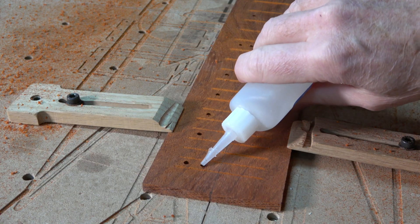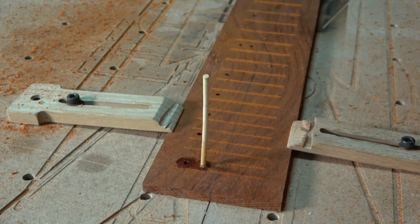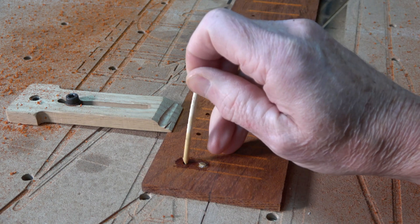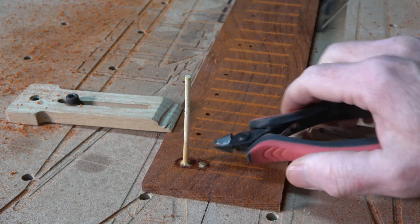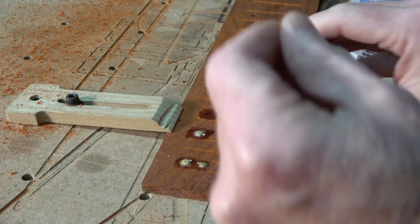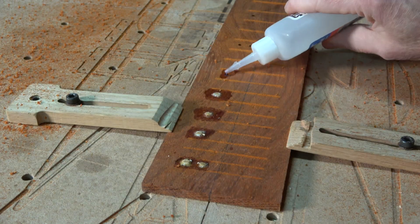For the dots themselves I'm going to be using an eighth inch diameter maple dowel, and that will give nice contrast with the padauk. Padauk is a wood that looks a dark orange color and over time it will slowly turn more of a rich brown color, so there should be nice contrast between the maple fret marker dots and the padauk fretboard itself. I use CA glue and some accelerator to glue those dowel rod pieces into the holes. You'll notice I'm doing the work on the wasteboard without removing the blank, so that I don't have to reset up and home the machine and get everything lined up again — it's already done.